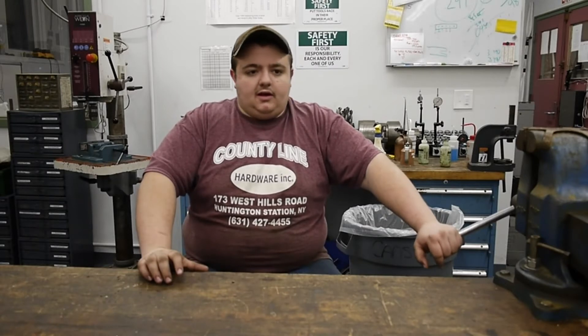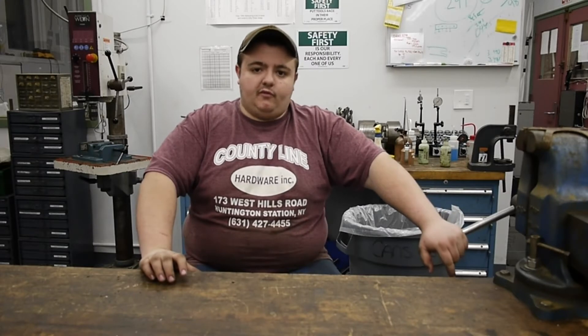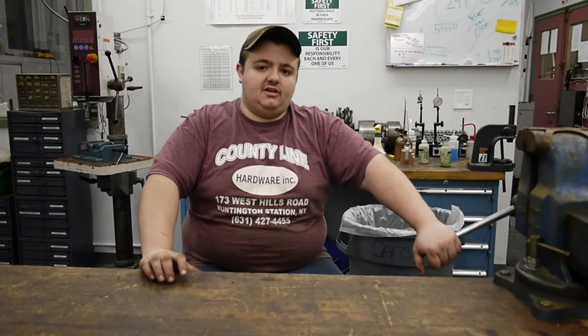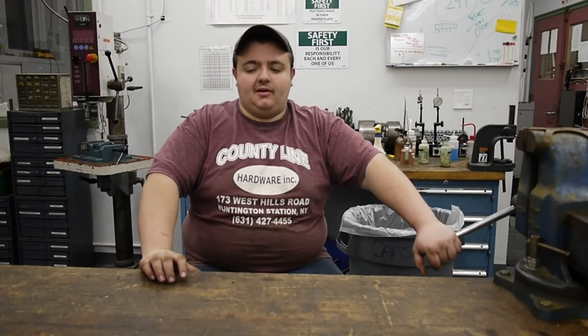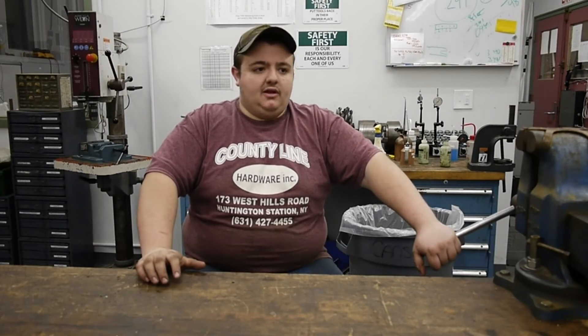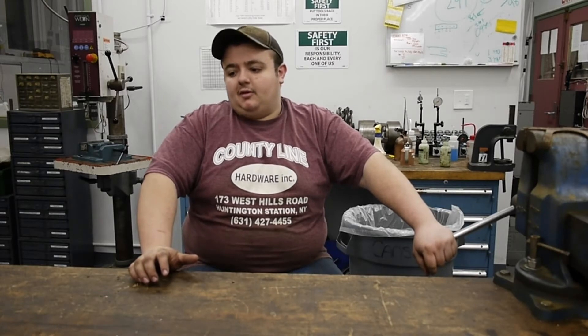Some of the equipment I've owned over the years — starting in high school — I've owned, with my brother, a Sheldon Vernon vertical milling machine and jig borer. That is a mid-1940s machine and it's very useful. It's in not the greatest shape; we were donated it by a great friend of ours. It can all be fixed. It was probably improperly used before we got it, and a lot of the T-slots were chewed up from using carriage bolts for hold-downs.